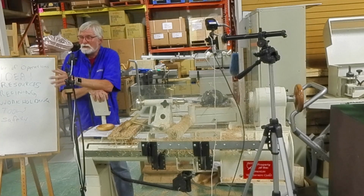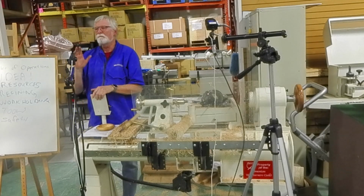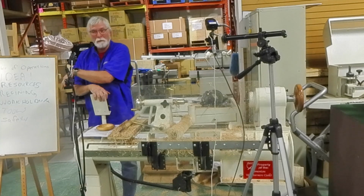Warm boxes, you can put several pieces in there, let them dry out if they're rough turned or even if they're green, and they will dry out. They're not complicated. There's a Canadian guy, Sprague Wood Turning. He's in Ontario, he does lots of hardwood. He builds them out of fridges, and he's got a YouTube video about building one out of an old fridge. And I thought about that too, but I ended up ultimately with a vacuum kiln. And we already did that talk. The vacuum kiln is magic. That's what I can use my old cooler for. Yeah, there you go. See, a warm box.